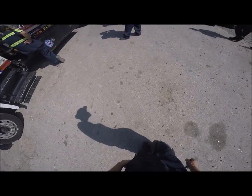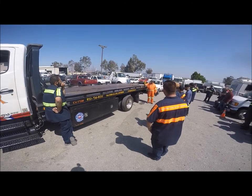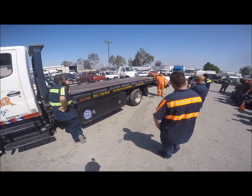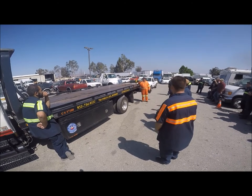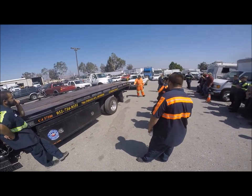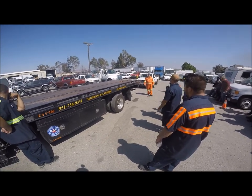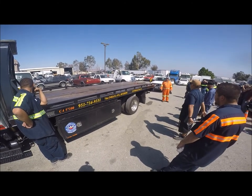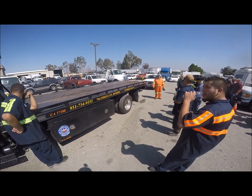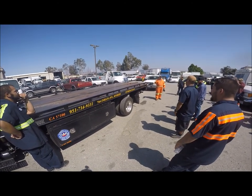As long as you've got 3,000 pounds on each of your tie-downs, that gets you up to 12,000 — one and a half times the load. Check your ratchets, hooks, and chains, everything you use for tie-downs. All car carriers now have controls on both sides so you can operate from either side. Miller Industries normally has theirs color-coded — this one is color-coded to the winch — but they're also labeled. There are only two controls for the wheel lift on a car carrier; unlike a normal wheel lift we don't have tilt — only up/down and in/out.